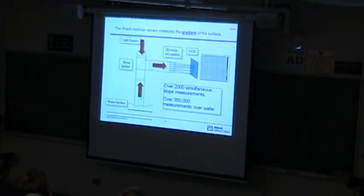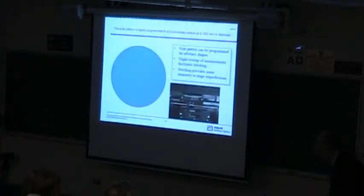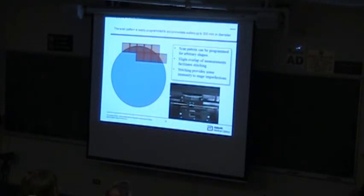The way you do it is very simply, you just bounce the light off of the wafer, send it onto a high resolution sensor. This is probably the best sensor that we've ever built. Not a super high resolution, about 0.28 millimeters, and it's just based on the fact that these are 300 millimeter wafers, we had some a priori knowledge about what the structure from SEM measurements was, and so we knew to expect it to be in that sort of category. The measurement is made by scanning and stitching. We just move the wafer underneath the sensor, and we overlap little portions of it in the corner, about 10% of each edge. By doing that, in these overlap regions, we've measured the same surface of the wafer twice, or in some cases, little corners even 4 times. And by comparing those, we can see if there's any stage error or any motion in the machine in between.